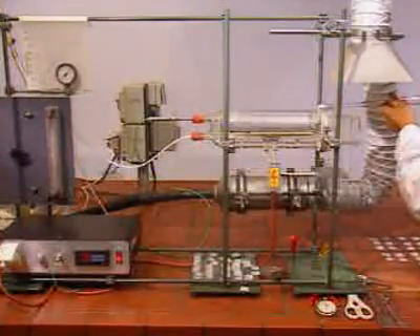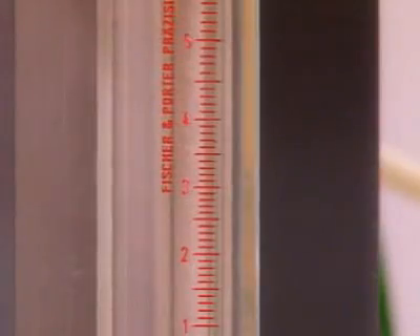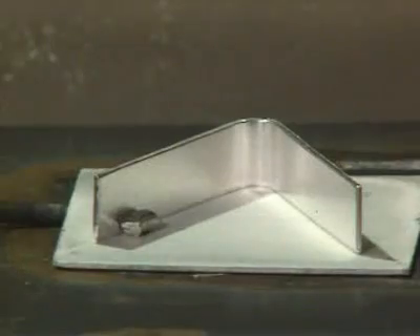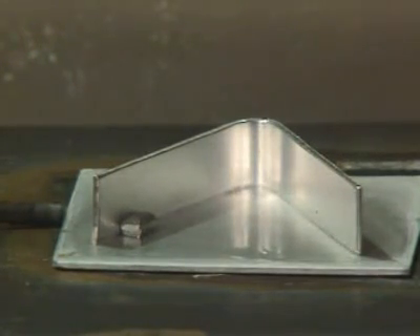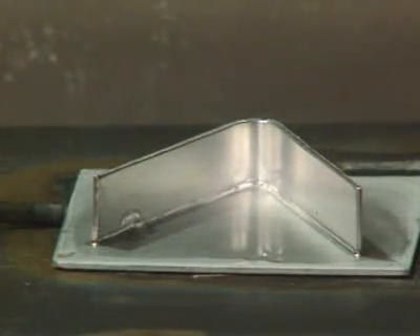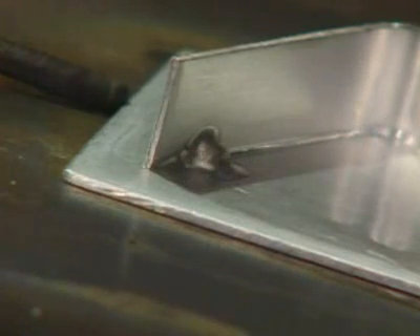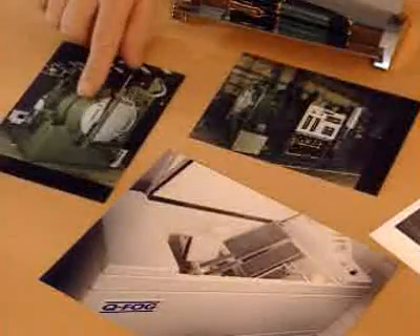In this experimental set-up, you can see how the work pieces are joined by the brazing alloy. Nitrogen is added throughout the brazing process — just like for real. Now watch carefully: the temperature in the experimental furnace is around 600 degrees centigrade. First, the flux melts and gets rid of the oxide layer. Then the brazing alloy melts and joins the two work pieces. Most impressive. And what about experiments on an industrial scale — with real heat exchangers? At our technical centre, in the batch-type furnace and in our corrosion chamber, to name two.